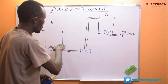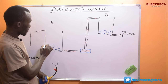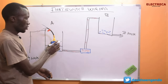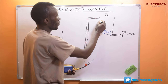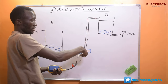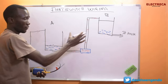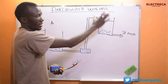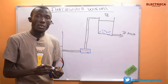You set a threshold for each float switch. If the water in the ground tank drops to that level, the float switch will flip and turn off the pump. Similarly, if the overhead tank reaches its set level, that float switch will flip and switch off the pump. Either float switch can switch off the pump regardless of the other one's position, because they are connected in series.